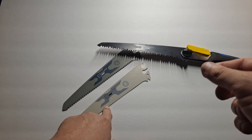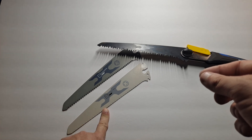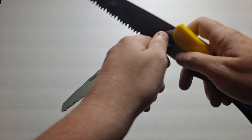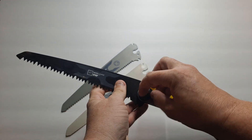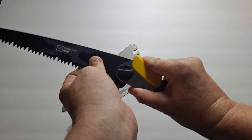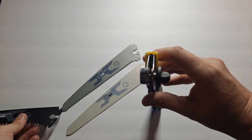I have used the metal blade — this is actually an extra replacement blade because I dulled the other one out cutting lots and lots of conduit. To swap blades, take the lock out, loosen the thumb screw — there's a point where it suddenly gets loose.